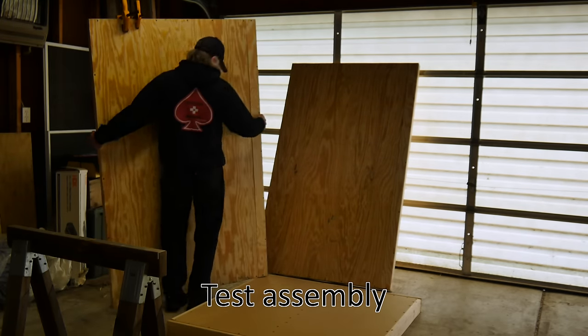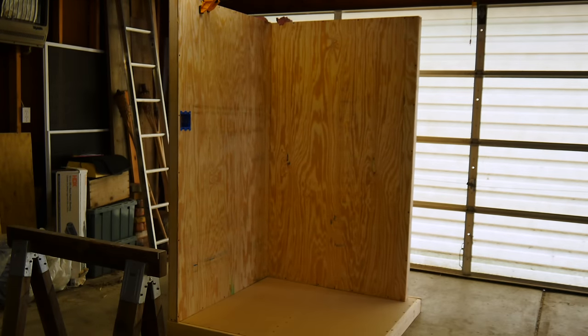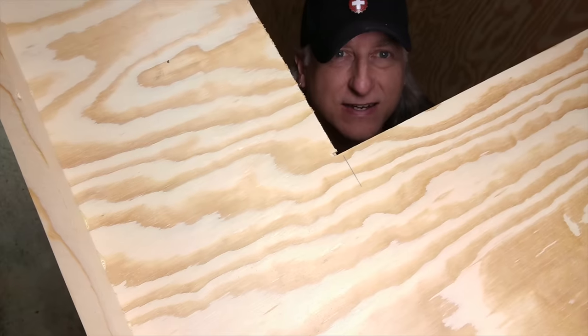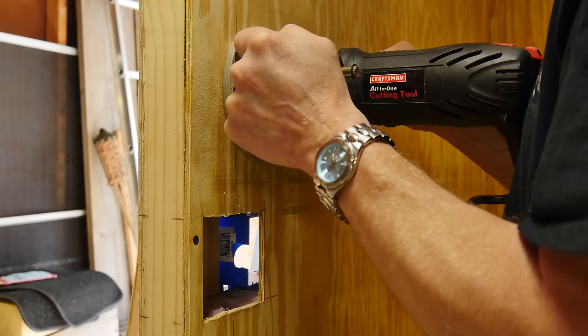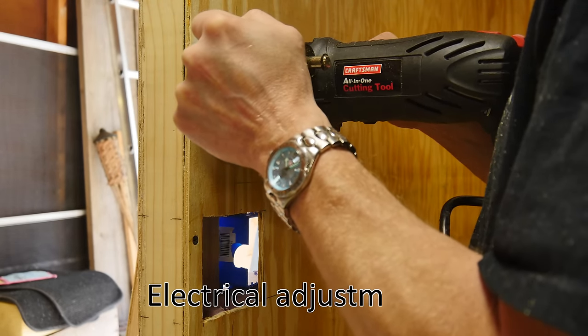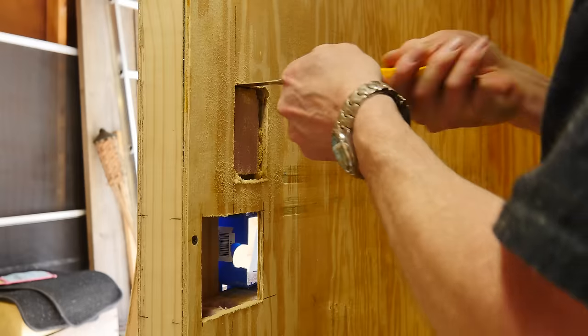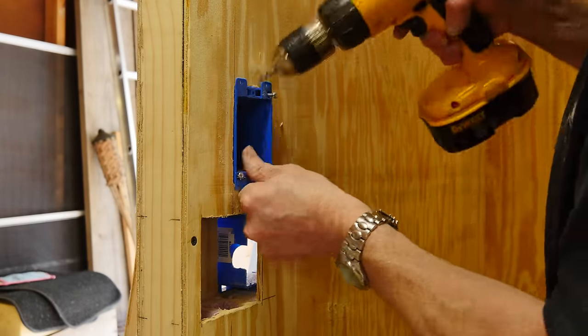Let's do a little test fit of what we have. You can see the base made out of two-by-fours with the one-inch floor that's recessed, then the two-inch styrofoam walls, and the electrical in the one on the left — that's the wall you'll face when you do the recording. Put the roof on — that's the hole where the light's going to go. There's going to be a door where I walk in and out, which we'll build at some point. I made a little miscalculation on the electrical — it can't quite go to the corner — so I need to come back with the Roto Zip and route out another opening for the dimmer switch.